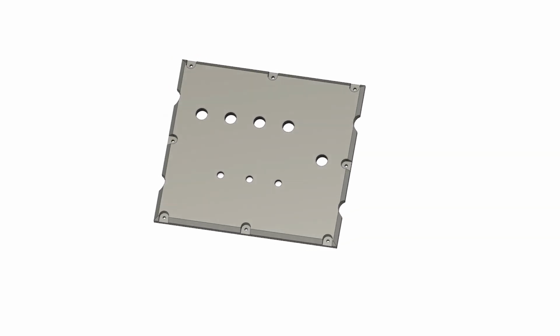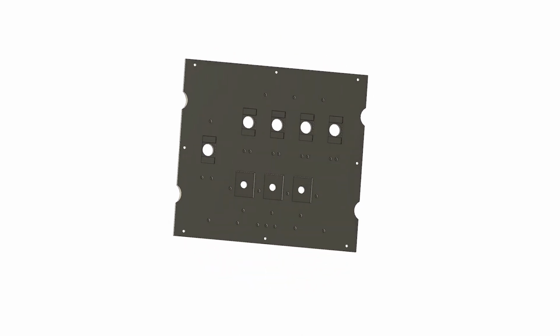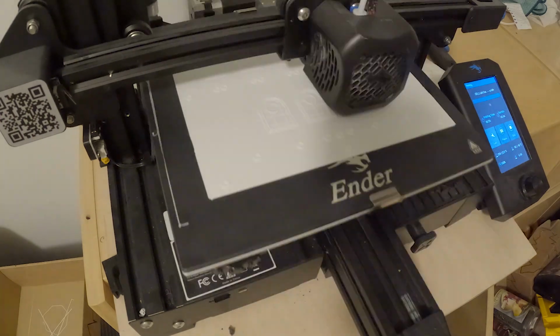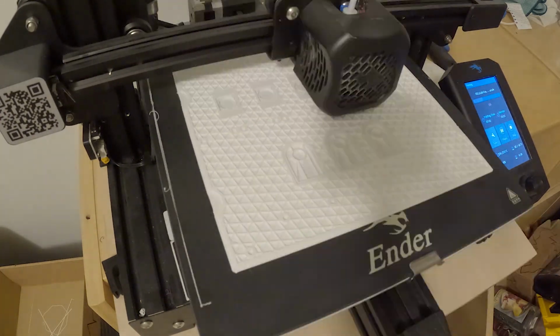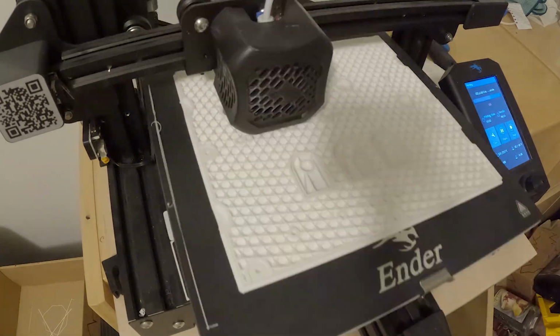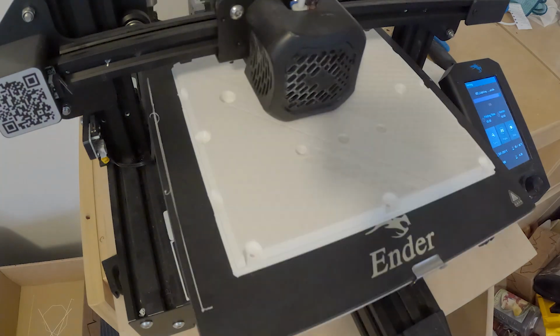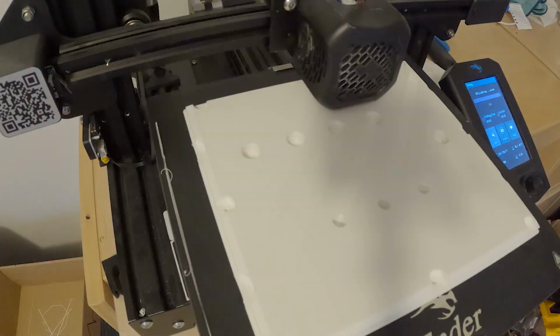The basic approach I have to building the panels is that I start designing the panel in Fusion 360, and when I'm happy with it, I'll take the file and 3D print it in white PLA. The reason for the white PLA is that it is translucent, so I can use the background lighting. When I'm happy with the print, I'm just sanding it quickly and adding a few coats, I guess something like 3 coats of spray paint.